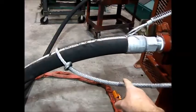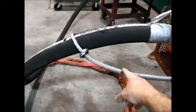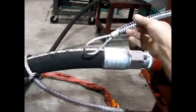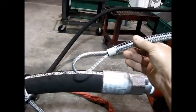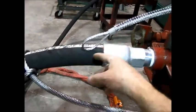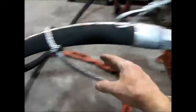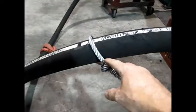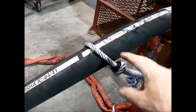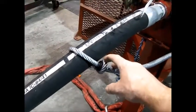We're going to be testing our CC 7-16ths cable choker. A lot of times you'll see a whip check in the field, like this type here, where your sleeve slides over a spring in the center. This simply loops over the hose, where our cable choker has a nylon insert in this area right here that chokes in on the hose. Works very well with some of the new high-strength hoses.